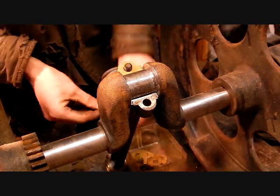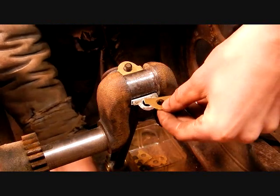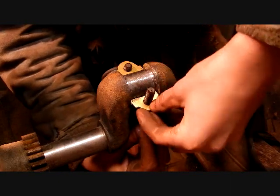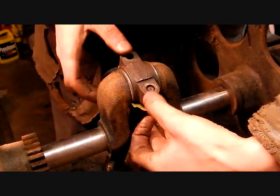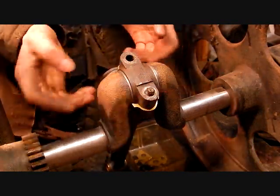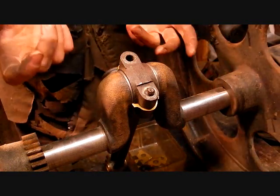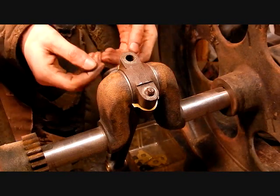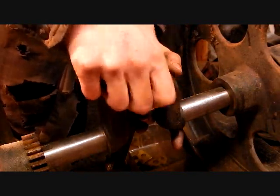It's good to have a number of thin shims as opposed to one or two thick shims, because that makes it easier to maintain the bearing as it wears. Say in ten years when the bearing starts getting sloppy — I'll pull the cap off, take out one thin shim, put it back together, and it'll be just right. But if I have to take out a big thick 30 or 40 thou shim, it's going to be too tight and I'll have to stop and make more thin shims to get the tightness just right.